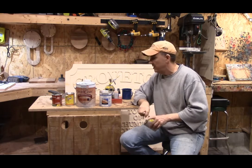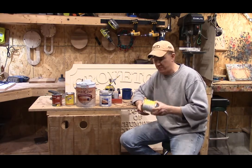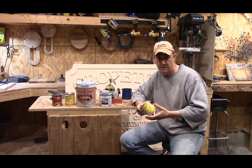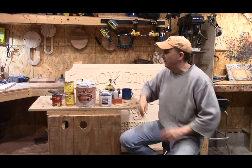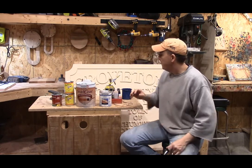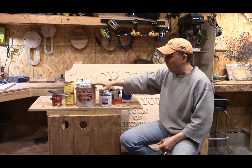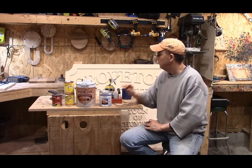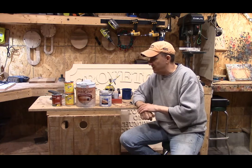Makes sense. Now the One Shot, well, anybody who uses this knows it's good paint, but they also know this is rather costly. This stuff can exceed 125 bucks a gallon. So it's not for the financially faint of heart. But after the sanding's done, we're going to seal it with our wax-free shellac. Probably a couple good coats there. We'll scuff everything lightly with the little foam sanding pads.